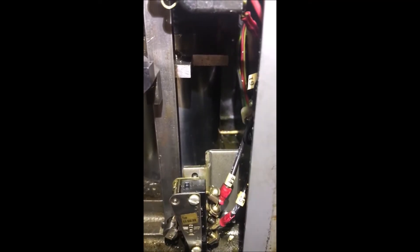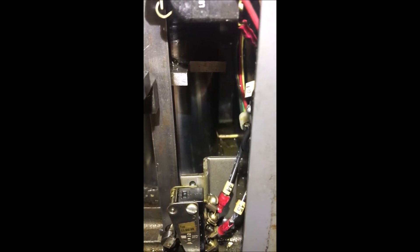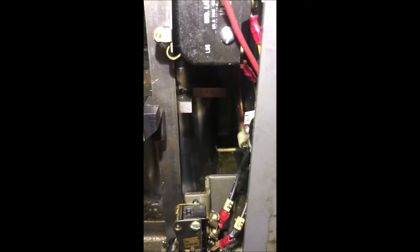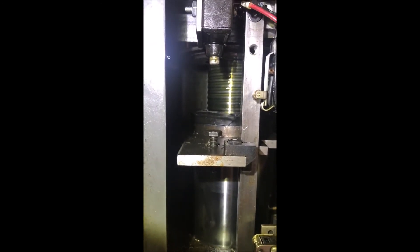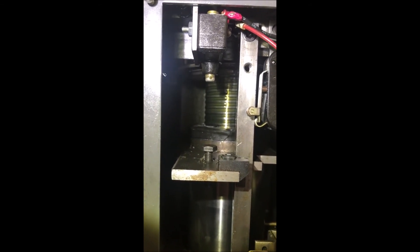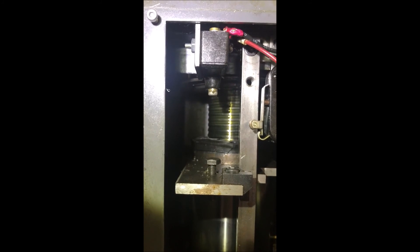I'm feeling better now. That little tube back there in the back is the one oiler I have easy access to. After pulling the plunger up a few times I can see that oil is starting to pool underneath it — that oiler oils the z-axis up-and-down travel. I can also see the lead screw up here that makes the z-axis go up and down, and there's definitely oil on that lead screw now where there was not before. So I'm feeling much more confident that the oiler is working the way it should. I've probably got way too much oil on the machine now from pumping it multiple times, but you really can't have too much oil — it's not going to cause any problems other than just a mess.